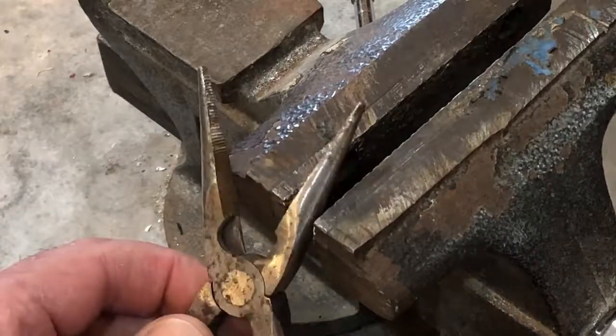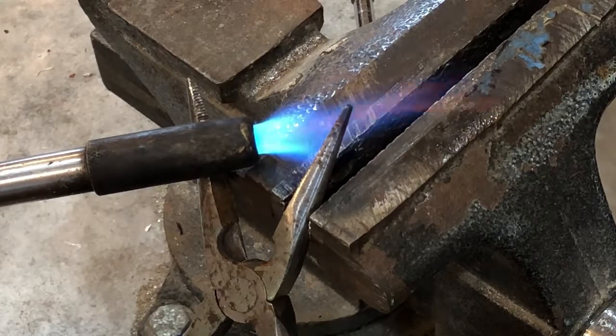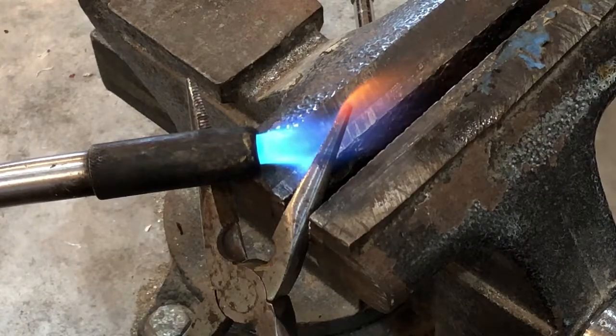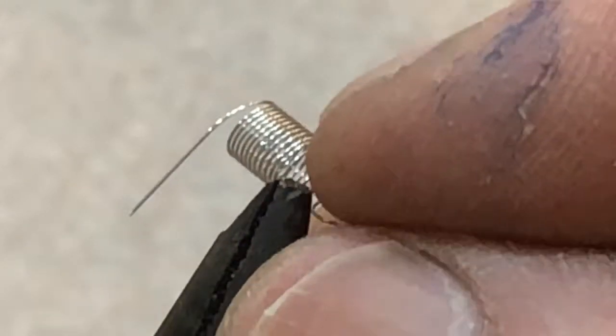To do that, I modify a pair of needle nose pliers. A common problem with needle nose pliers is that the tips don't make contact, making it hard to grasp small things like small diameter spring wire. To make the modification, I use my blowtorch and my handheld multi-directional dimension modifier. A few well-placed blows is all it takes. That's much better — now we just need to do a little grinding and we'll have it. To bend the first loop on the spring, I slide the ground tip of the needle nose pliers up between two loops of the spring, then carefully bend over the loop. And there's one end bent over. After bending the other end, I'm quite happy with how that turned out.